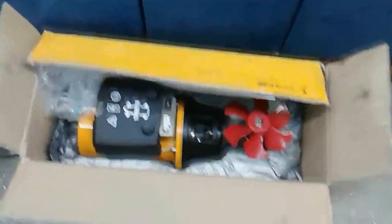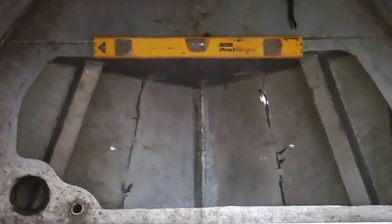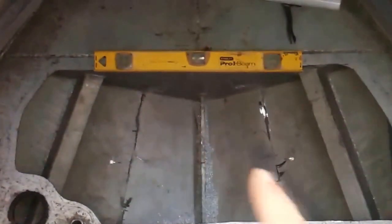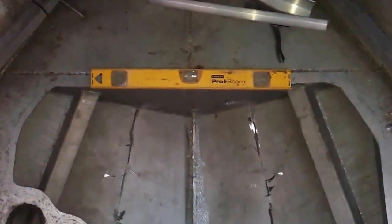Here's what I want to put in the front of the boat — the bow thruster. Here's the tube over here. Five and a six and a quarter. Here's where I want to put it, here's the new helm — working on all this at the same time. Here's where it's got to go in. I drilled the two holes on either side there, one there, and I'll show you how I drew the outside of it.